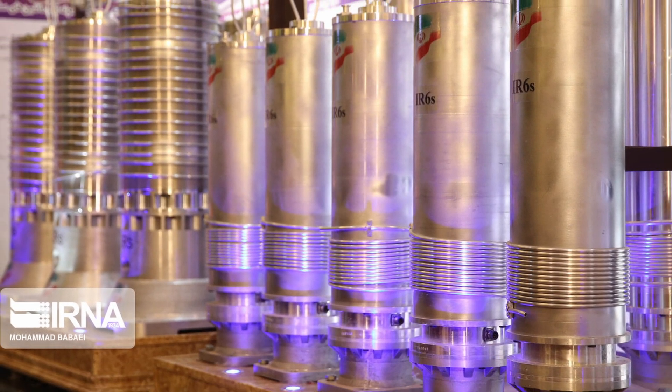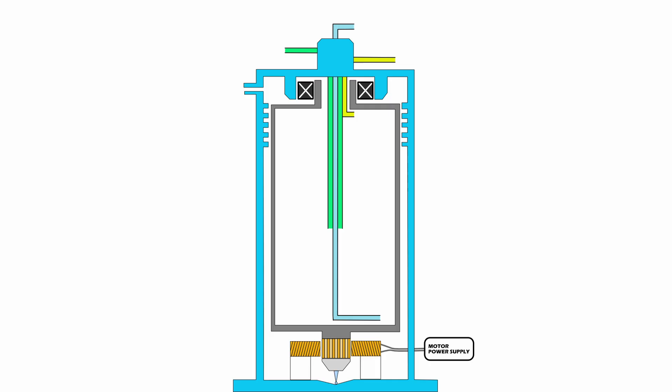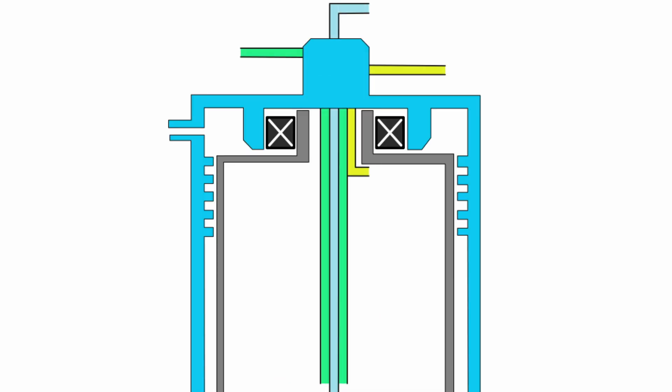This is how it works. The gas centrifuge has the following main parts: a rotating chamber, an evacuated chamber, a high-speed motor, a support bearing for the rotating chamber, and a gas exchange mechanism for three gas streams. We begin with the gas exchange mechanism.